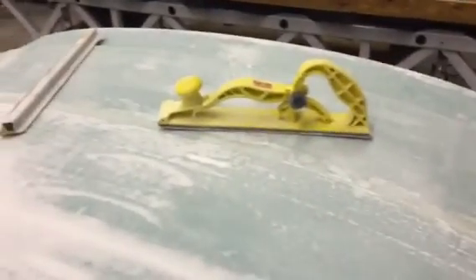Cut heavy — we used 36 grit and then went over it with 100 grit real quick, and you can see lots of scratches, but that's where you want to be right now. It's time to get on a guide coat, a heavy thick layer of primer. Since this is the plug I don't have to worry about thin material — get down a guide coat of primer and then we'll start to fill and sand. Once you can actually see what remains of trouble — almost invisible here, you have to really hunt to find any low spots — as soon as we put a coat of paint on them they'll come screaming back out and we'll be able to fill them and finish. Kind of an exciting day with this plug; it's gone along a lot faster than I thought, incredibly good geometry result — and yet wow, does that look ugly or what.